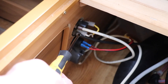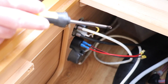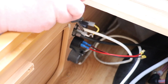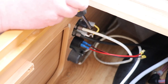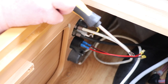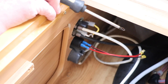We're going to piggyback off these two connections here using our new lead. In this case you can see there is no red and black on this plug - it's yellow and white. Yellow is positive and white is negative. I know that already because I've already tested this. If you're unsure on your wiring, please check it with a multimeter to make double sure. So we're going to unplug these connectors, and then our red cable and our black cable we're going to plug straight onto here. Because we've got the two spade terminals left over, we plug the yellow one and the white one onto those.